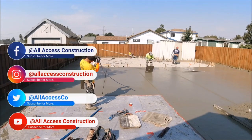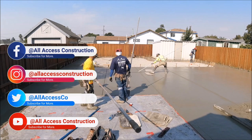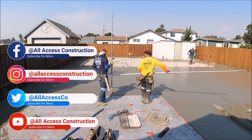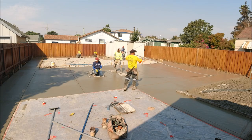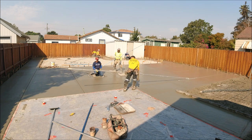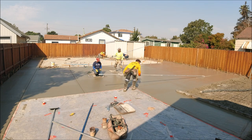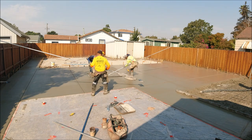We've probably got every concrete finishing tool out there. We use our edgers to make sure our edges are nice and clean, we got a torpedo to cut open our joints, and once those are cut open we use our groover to make those joints look nice and pretty. We've got a guy way in the back right-hand side working a fresno. It definitely takes teamwork to make all this happen.